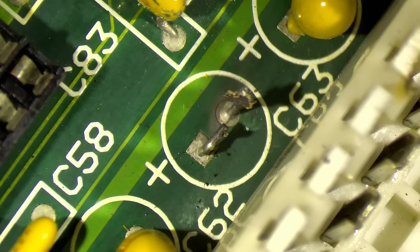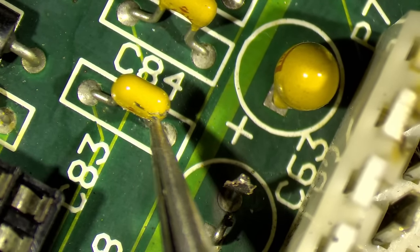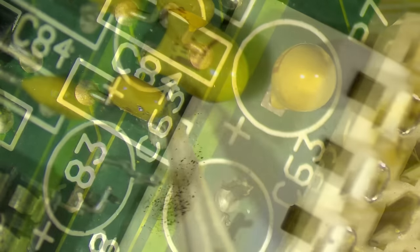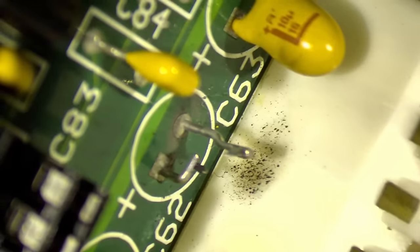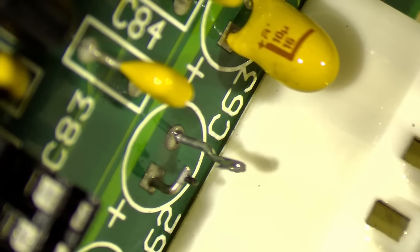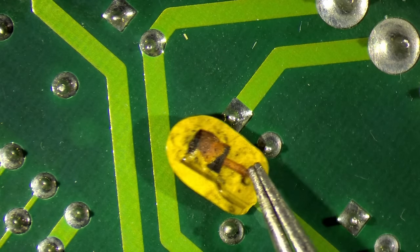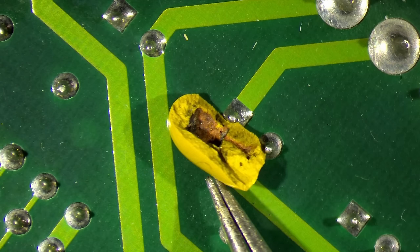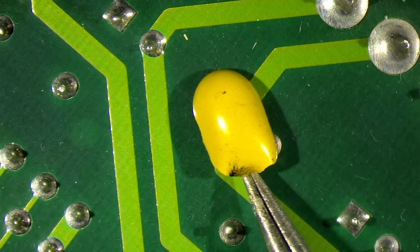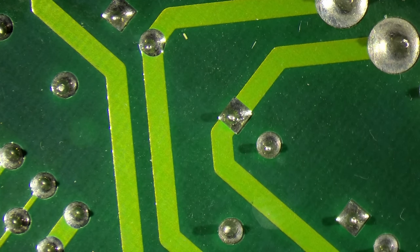Okay, what happened to this friend right next to our one? What happened to this one that is right next to it? Oh, this got some solder splashes all over it. Here's also some black residue left. This probably will not go, or does it? It cleaned up nicely. Okay, maybe we can make this look like as if never anything exploded on this board. By the way, here is one half of the tantalum capacitor. So yeah. And of course it's the side without the markings. But all those tantalum capacitors have the same value. I checked this before.